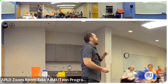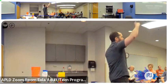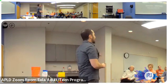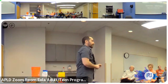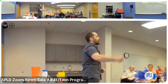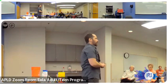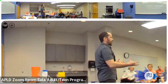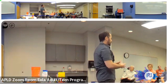All right. Have them out once a year in the fall, and then wait a year and a half and have them out in the spring. And then do the same thing, okay? So that once a year, it's getting looked at, all right? But every other year is the furnace and the air conditioner, okay? For most people, that will get you by without an issue, okay? Sometimes you have an environmental situation that requires that air conditioner condenser outside to be cleaned every year, okay?